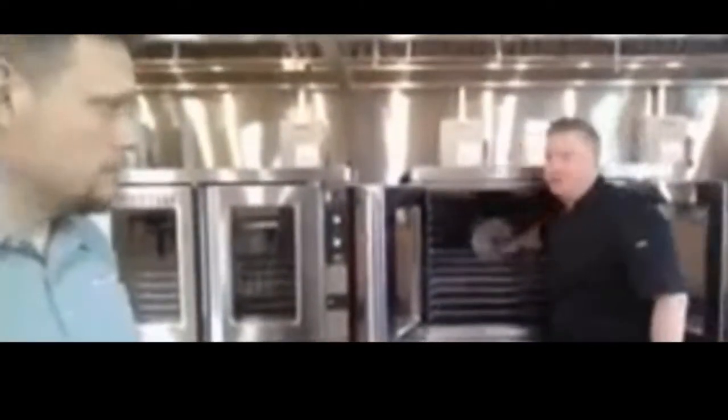General cleaning, Dan. So let's say they have the oven and they're cooking in it for quite some time and now it's dirty. What do you recommend to clean the inside? I recommend grease cleaner, some standard stuff that you can buy. You want to make sure that you clean inside of your cavity. Do not spray stuff onto your blower wheel.